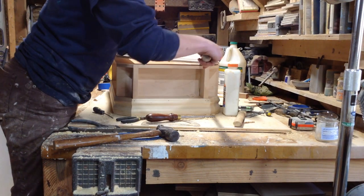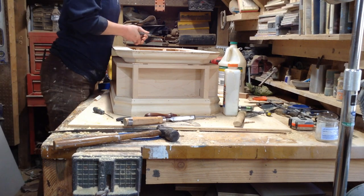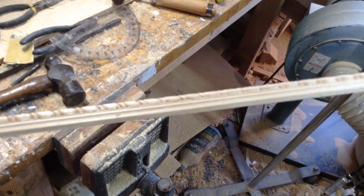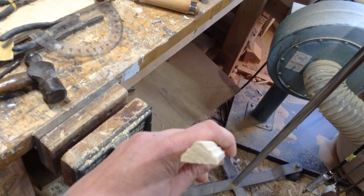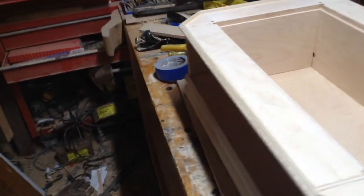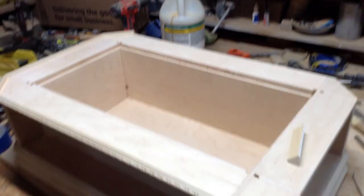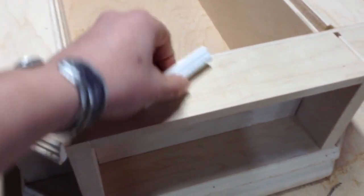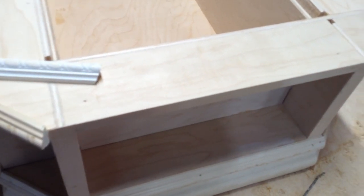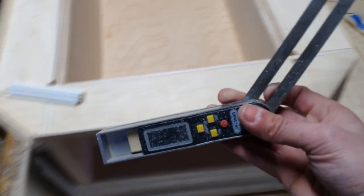I put that aside and moved back to finishing up the casket. I popped off the top, snipped off the brads that stuck out, and then I could continue working on the base. I'm putting what I'm calling a rope molding on the outside. This was the easiest one to cut because it was symmetrical, so I didn't have to worry about flipping it. The angles are going to be the same as the base, and it's covering the edge while also creating a lip on top which will cover the plies left on top of the piece. I'm using a scrap piece to get all my angles right — I believe it's three-quarter inches thick. I'm using a bevel gauge to find my initial angle. This is actually a digital gauge, but my batteries are dead.